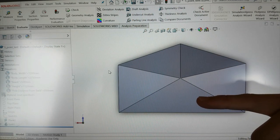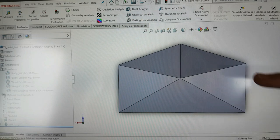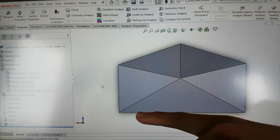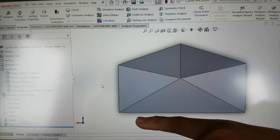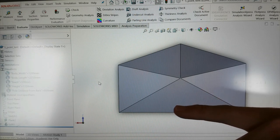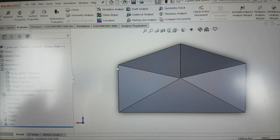And then from those numbers, Finley's built a parameterized model, and you basically put in this dimension, the height, and then it spits out the model for you. Then he'll be able to extract the lengths of, for instance, this line, because I'll need to know the length of this line. Instead of having to calculate it all, Finley will take those parameters and use the measuring tool to measure this line, and then I will use those measurements and some Euclidean geometry and we will convert this to a 2D design.